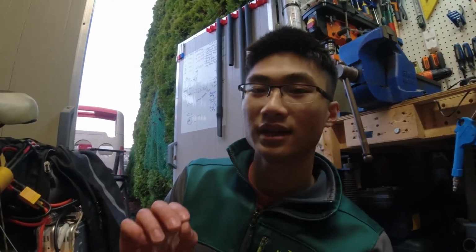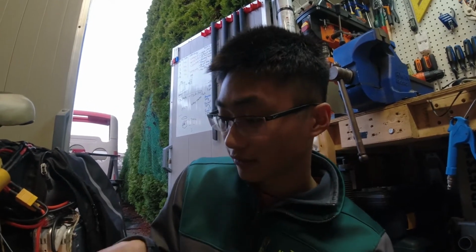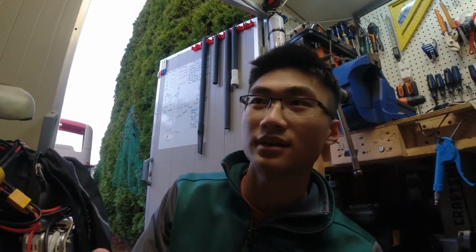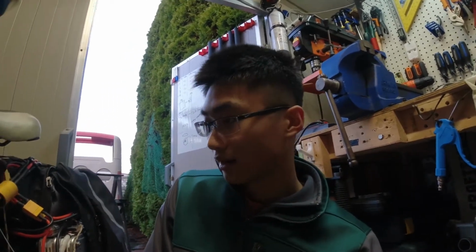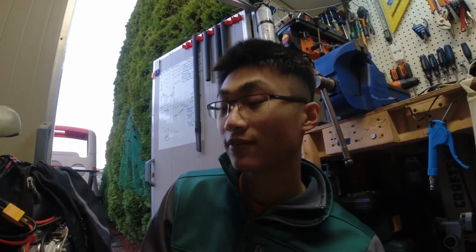As for torque, you need to get the right balance, because if you make a very small friction wheel, like I did, the motor just kept slipping. What I would have to do is reduce the current and limit it to like 400 or 500 watts to get it to not slip. So you can get that, but then you'll have low top speed. You have to really size it for the motor.